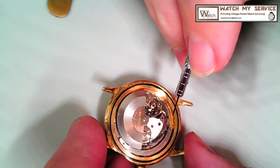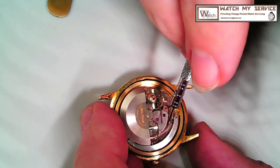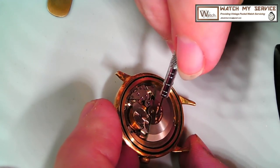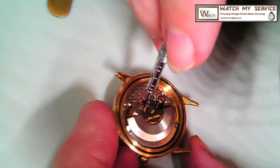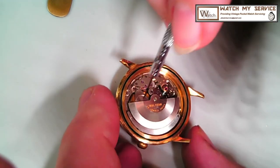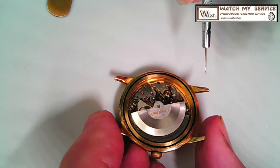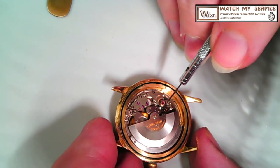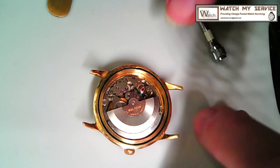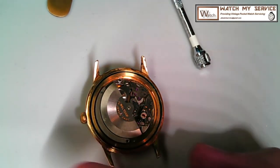I think if you remove this plate, all this stuff comes off. But on this plate is also the escapement, so it may not just be the rotor mechanism that comes off. There's also a screw here that might be used to remove that. So it's a bit of a mystery - I'm going to ask for help. I don't want to ruin this watch because it's a pretty nice, high-end 25-jewel watch. The movement's not running well; I looked at the hairspring and it's kind of bunched up. I'm wondering if demagnetizing it would cause the hairspring to unbunch, so let's try it.